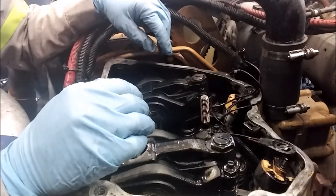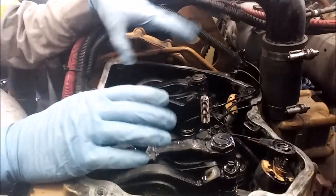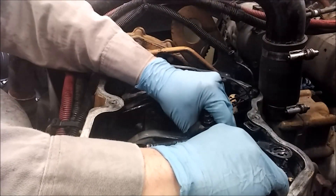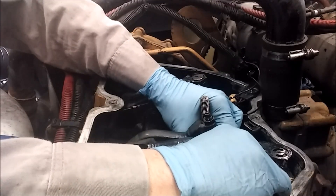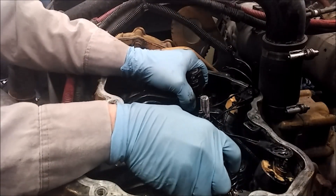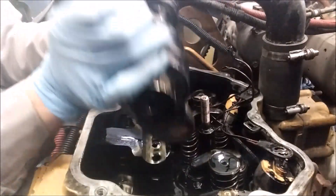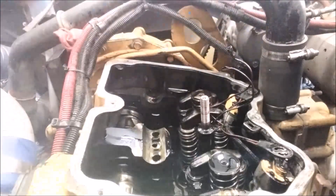The rocker arms for one and two are linked with a cross shaft. After you remove the bolts, you're going to have to pick them up. CAT makes a tool for it, but you can do it with your hands. Make sure the bridges have separated from the intake and exhaust rocker arms, because they tend to stick when you pick them up and they might fall down — you want them to stay on the valves. You just grab them kind of like you're grabbing two crab claws, and then flip them up and let some of the oil drain off. Then your rocker arms are removed.